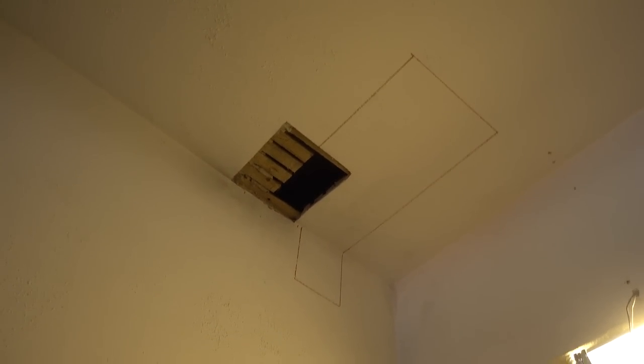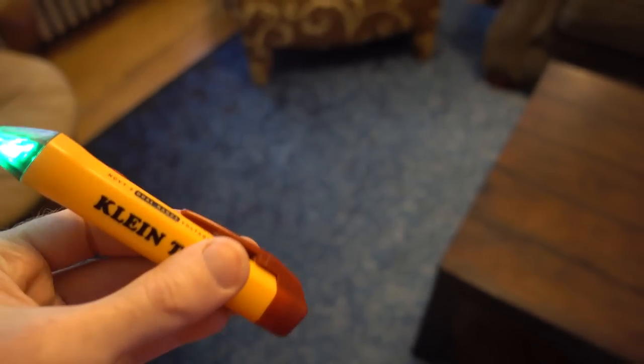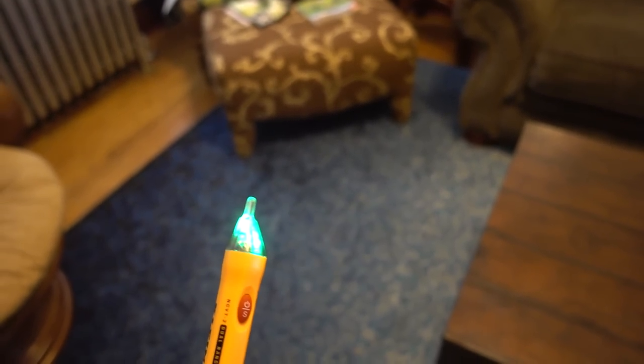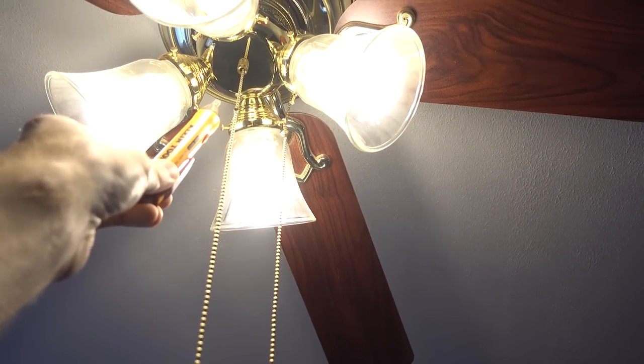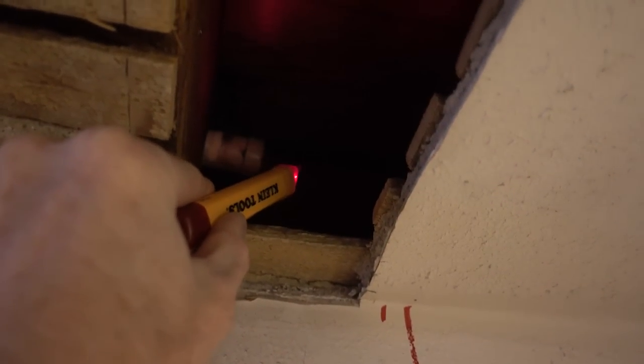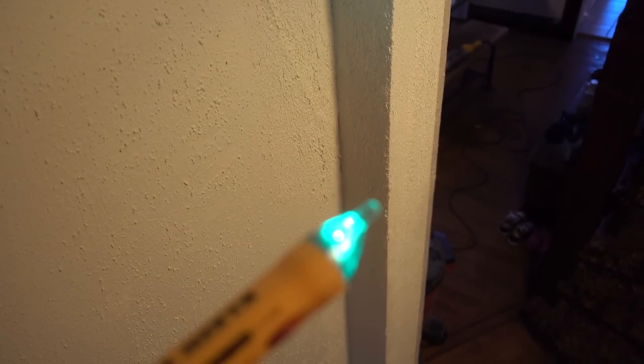So we've made some further progress on the downstairs. We have the pipe run all the way from the third floor down to the second floor, and then it ends right up here in this ceiling. You can see my red marks here where I'm going to have to cut a little bit further. The first hole was primarily just for exploration. So this is a non-contact electrical testing tool made by Klein Tools. It uses the electromagnetic field generated by alternating current to tell you if there's live current nearby without physically making contact like you have to with a voltmeter. So you hold it up near this light, get it close, it turns red and it beeps. We're going to use this to confirm if our knob-and-tube is indeed live, as I suspect — and yes, there is power in that knob-and-tube wiring that I'll have to go find a breaker for.